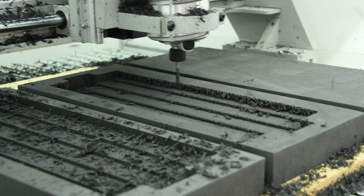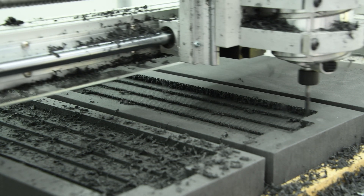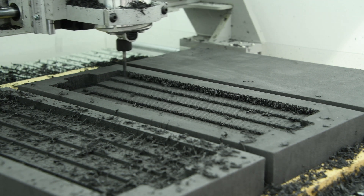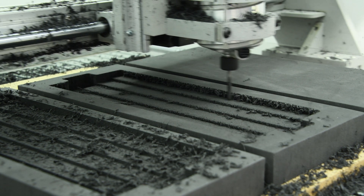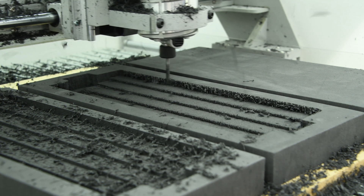Datron tools also tend to be geared towards higher speeds, which is great for us since we're running a CNC router that operates at 8,000 to 24,000 RPM. We ended up buying a 6 millimeter diameter tool with a 27 millimeter flute length — a bit more than an inch — which worked well for us because our deepest foam pocket was just a bit shallower than that.